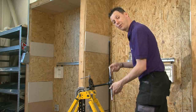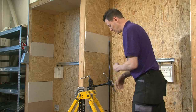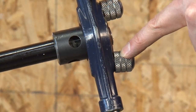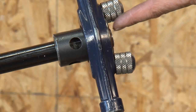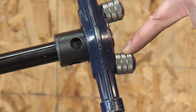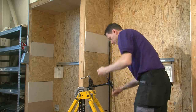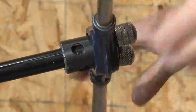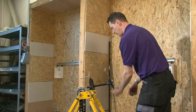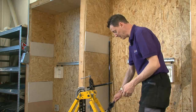The amount of thread you need for a 20mm pipe is approximately 16mm. An easy way to verify this is that the first line on the nuts which hold the die and guide in place on the stock marks that point — so when the conduit protrudes up to that mark, you know you've got approximately 16mm. When you've reached 16mm, remove the stocks and clean out the swarf.